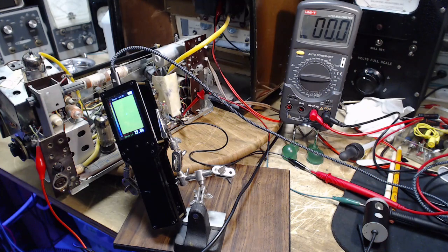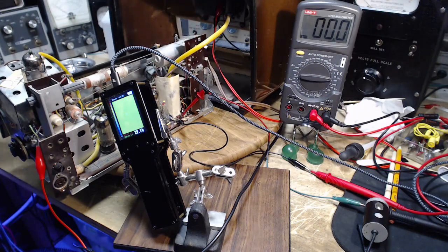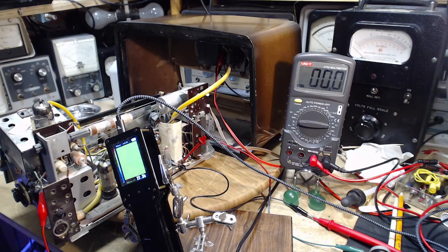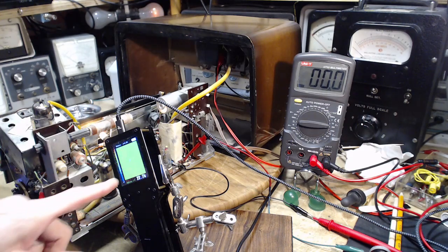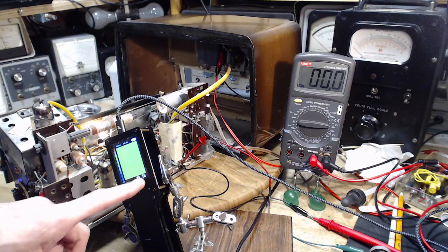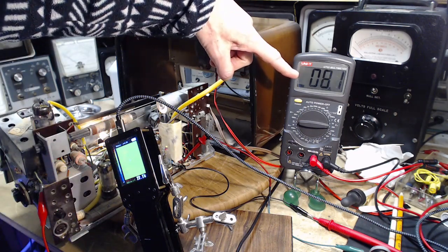Ready now? You're ready. Okay. Doing this through the dim bulb, the dim bulb light, which is back there, just to ease off the pressure ever so slightly on this radio. There we go. I'm watching. Okay, so the red plus is already settling in right in here. It's popping around now. Okay, so we're getting a voltage coming up here.